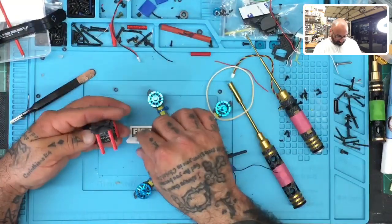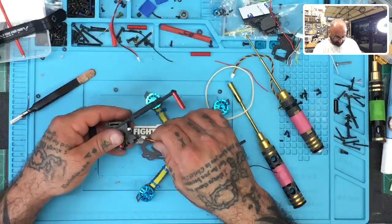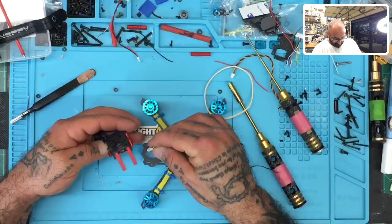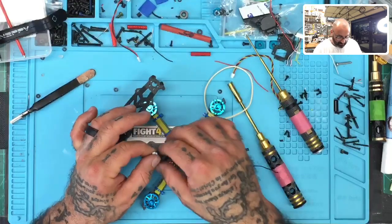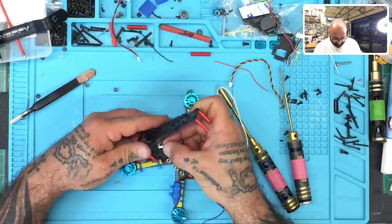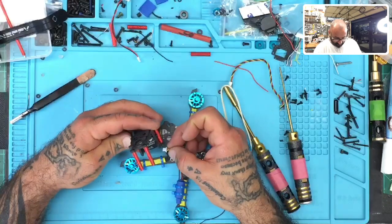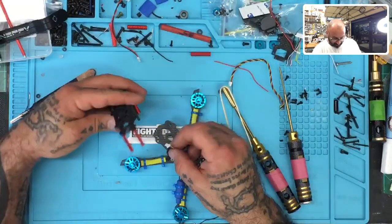So now we can just get ready to, as you can see, we've got the pattern is 5-volt, ground, video. So that's basically red, black, and yellow. And hold on, I have to make sure I plug this in properly because this is not the right pattern to make it fit the way I want. So let me just make sure first. Okay, these fit, but it's reversed. Ground is right, but the red and the video is wrong.